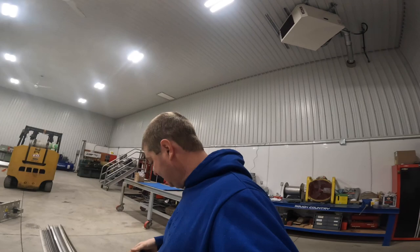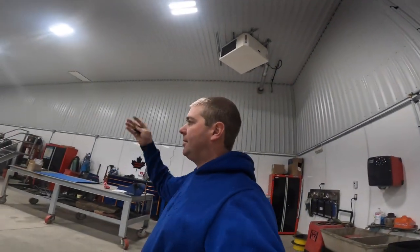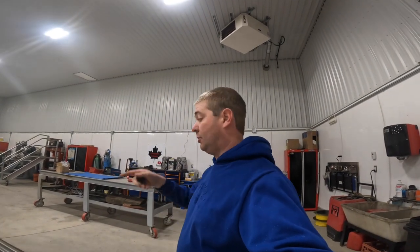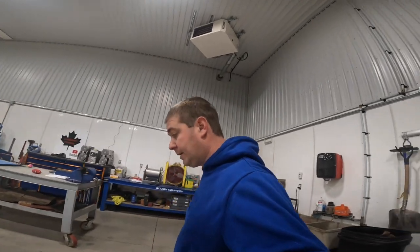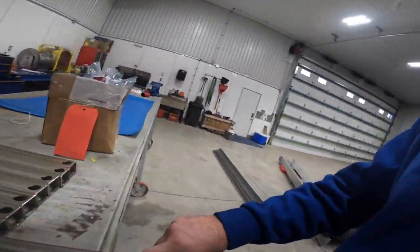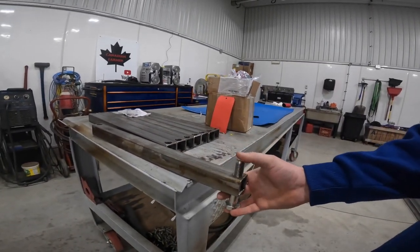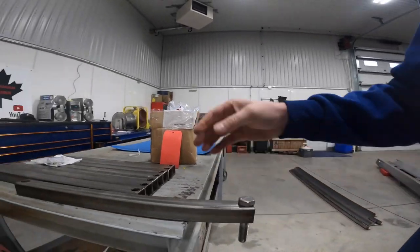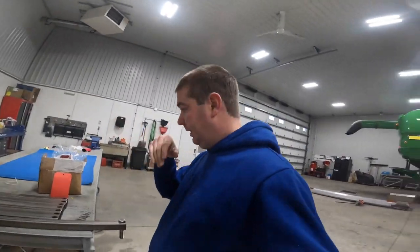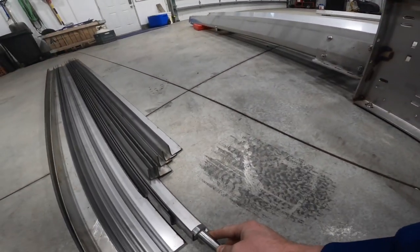Good morning again. So, couldn't carry out this video, about a week later since I picked this back up. So we got my angle iron. We're going to hang this off the top and attach it in three different spots, throw all the bracing through the trusses, and that'll be good and strong, is the game plan. So, stainless bolt, that's gonna hang underneath. Bolts are up. Actually, sorry, it's going to be this way. This will be the top angle brace, and then I can have that much adjustment to make it level, so that will be good. So we are going to weld this bolt to these pieces of angle iron.